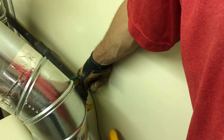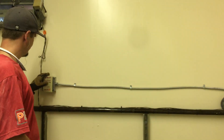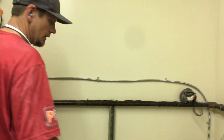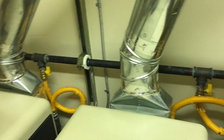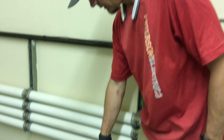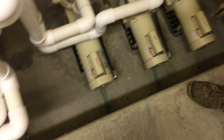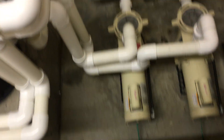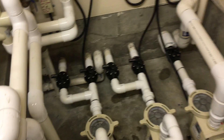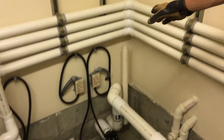We bonded our CSST pipe right here — it's gas pipe — and we have disconnects installed per unit, as required, with everything labeled. Each of these actually had to be bonded even though they're plastic, which is interesting. They bond through because there are grounds running through them, and then over and down. Each motor is bonded down below, and we connected it to the ufer that was already in the ground for all the grounding of the pool.